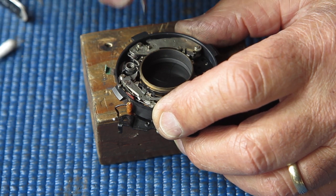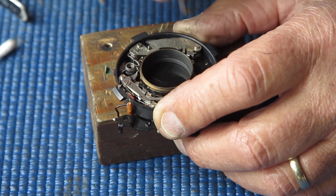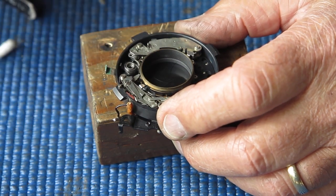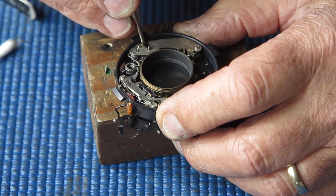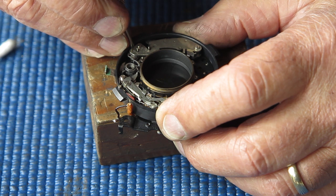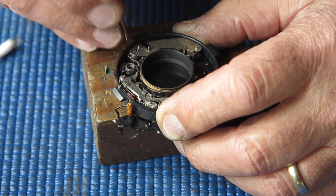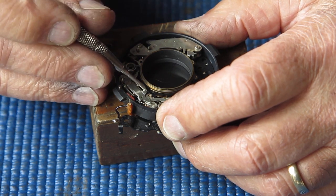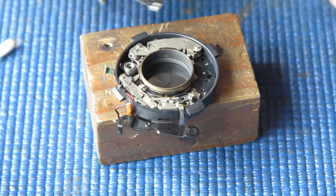The tolerance for shutter speeds was plus or minus 20%, with a repeatability of 10%. And so a really, really good shutter would probably be something like, instead of a 500th of a second, it would be something like a 450th of a second. And that would be about where you'd expect it to be, but a 400th of a second would be much more common, even on a good cleaned example, unless it had had everything going in its favour.